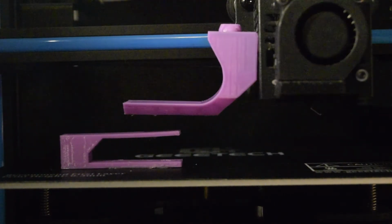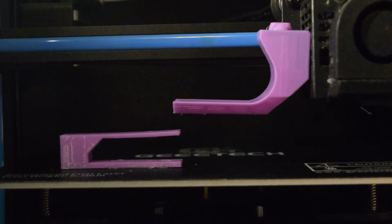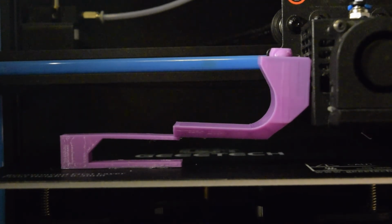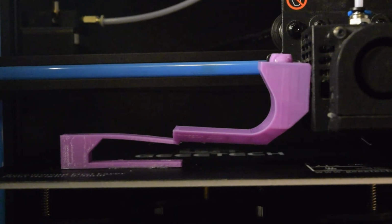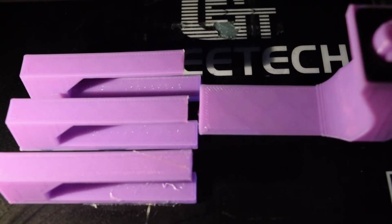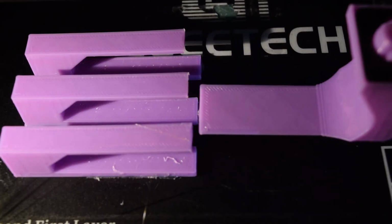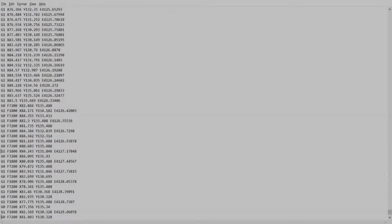Ultimately, we didn't get around to scripting the performance G-code for playing the cantilever. When designed though, this would likely consist of a positioning step where the tool is placed just above the cantilever in absolute coordinates, followed by a plucking step where the tool is moved down and backwards simultaneously in relative coordinates to deform and subsequently release the cantilever. If the coordinate of each cantilever tip was known, a simple Excel program could be written to convert simple sheet music into G-code. So that was how our G-code came together.